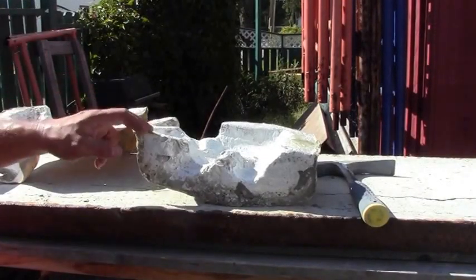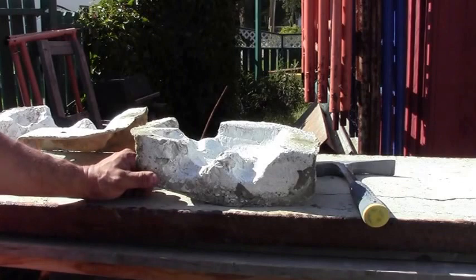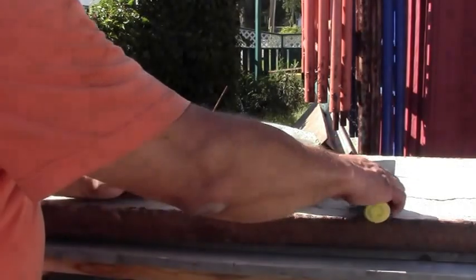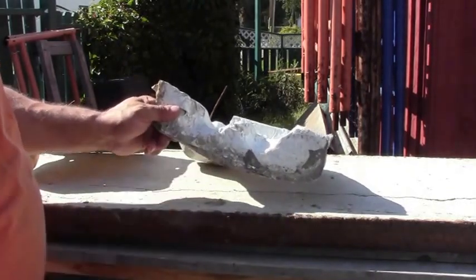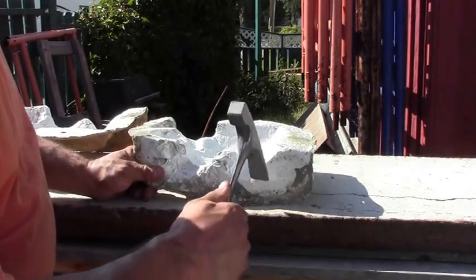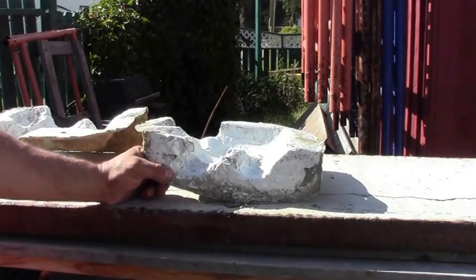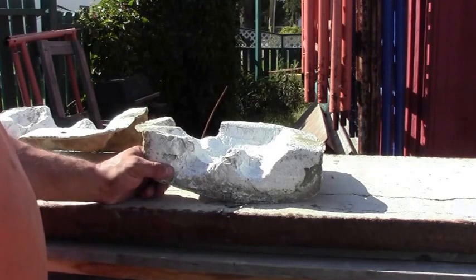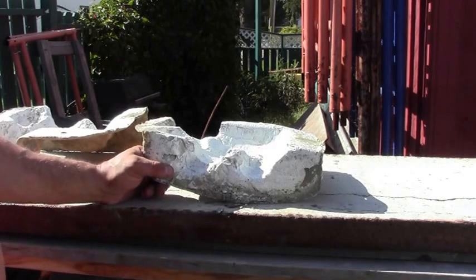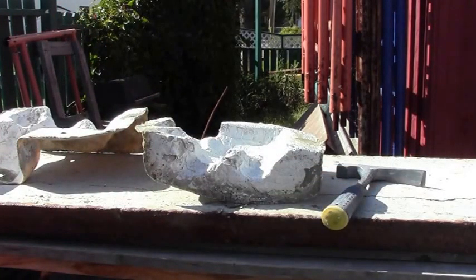You need to pay a little attention to the mother mold as well. If it's made out of fiberglass, you can throw it into the acid bath. You get this buildup of concrete on the edges — just very carefully take a pick hammer and very gently knock that off. Some people leave it on; it doesn't affect your casting, but it can sometimes get in the way of smoothing the bottom of your casting if the buildup gets too heavy.